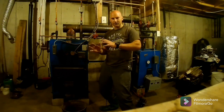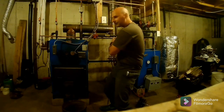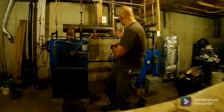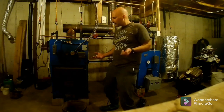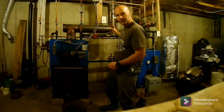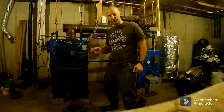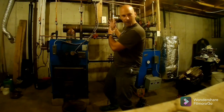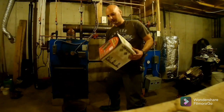Hello everybody, Gavin D here. Now because we are the 4th of September we might be starting to make fires in our furnaces. If you have a prefab and you're wondering how to clean it, or you might have moved into a new home, if you have a furnace you are most likely going to have a 7-inch pipe. If you have a wood stove you most likely have a 6-inch pipe.